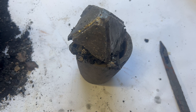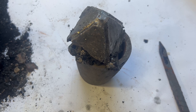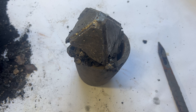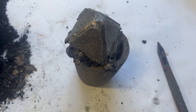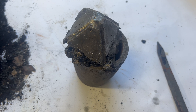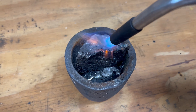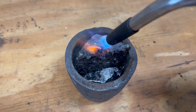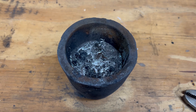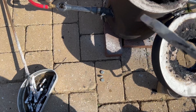Our lead here contains our silver and we need to separate it. I could oxidize it all away, but there's way too much lead here — that would take way too long and I don't have a large enough cupel to oxidize it in. So I'm going to use a process called the Parkes process. This process uses the fact that silver is more soluble in zinc, so when I mix zinc with the molten metal, the silver will dissolve into the zinc metal. The first step is to melt the lead in the crucible — with lead I can just use a torch to liquify it. Now with it all in the furnace, we can start the reaction. Plop a few pieces of zinc into it and we can get it going.